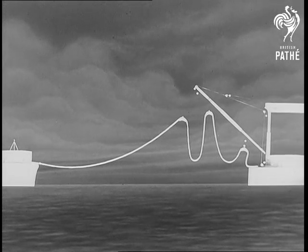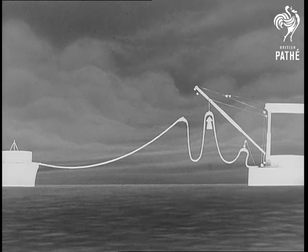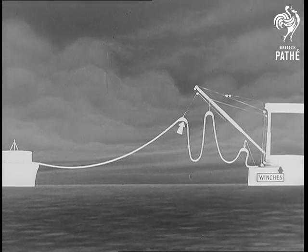The hose is carried in three troughs, each suspended from the derrick by its own whip or by a tackle. The first trough is hoisted by a tackle to about 10 feet from the deck and secured. The whip for the second or inner trough is led through a sheave at the lower end of the derrick head and then through a block at the heel of the derrick to a winch. The whip of the third or outer trough is led through a higher block at the derrick head, then through a block at the heel of the derrick to another winch.